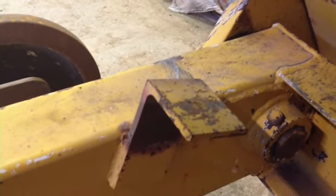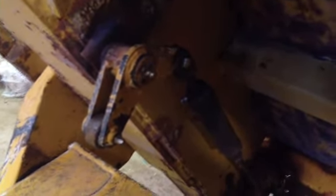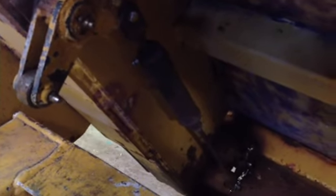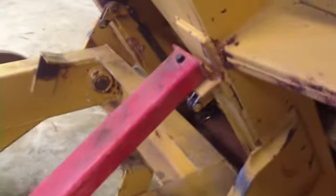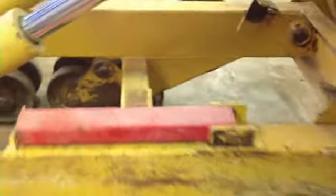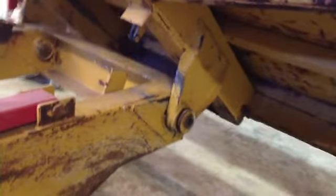You can see how that mechanism goes all the way up and then hits that piece of angle iron. If any pins or keyways are missing, or the rods are bent or broken, they all need to be repaired. The safety locks for the boxes have to be there in working condition, locking the box in the up position — see how the mechanism is working.